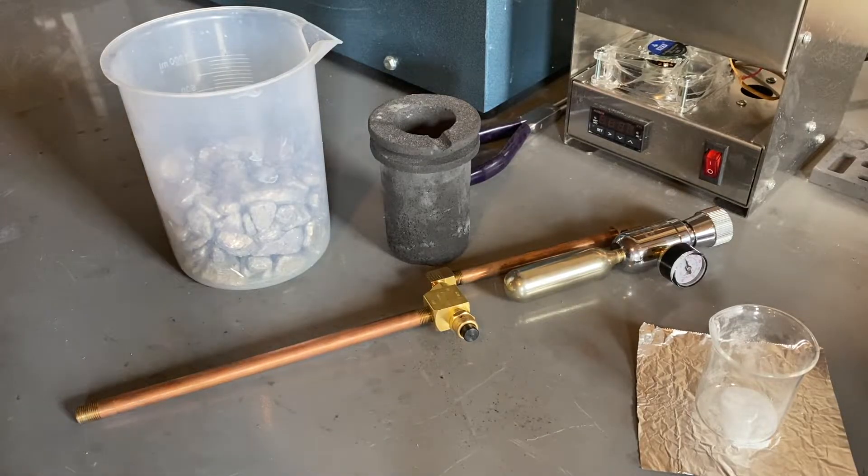The way people go about doing that is by using inert gases to produce bubbles in the aluminum. These inert gases bubble up through the aluminum, and as they travel through it, the hydrogen is absorbed into the bubbles and carried out into the atmosphere — away from the aluminum — resulting in a cleaner product.